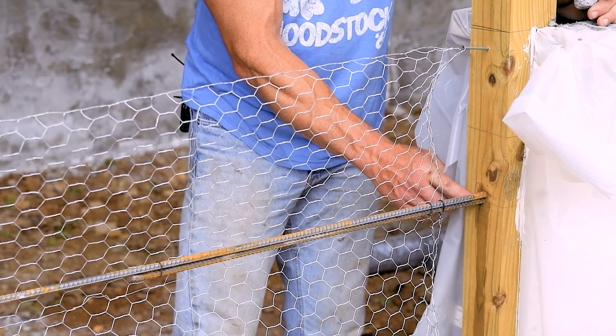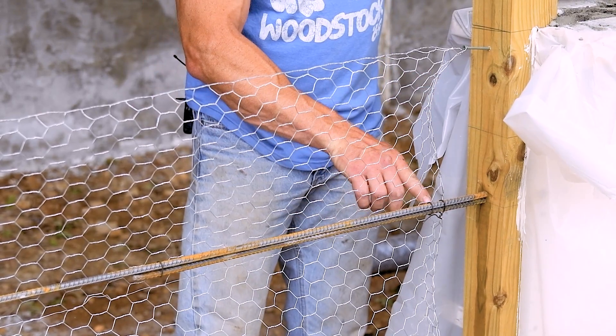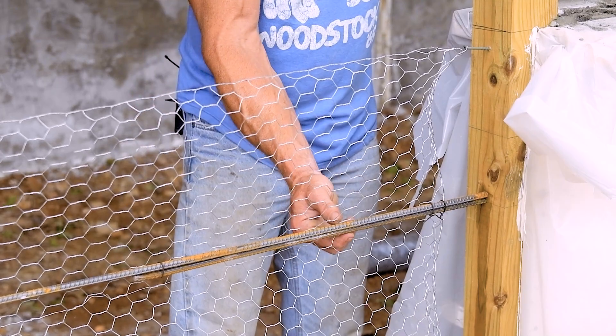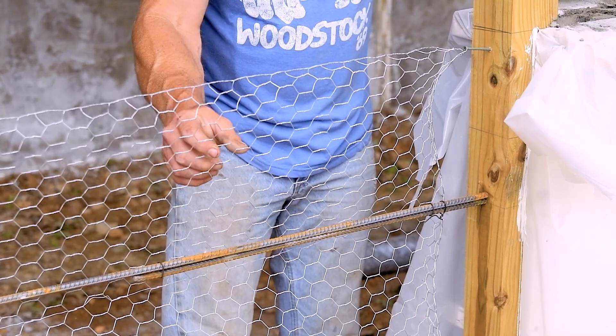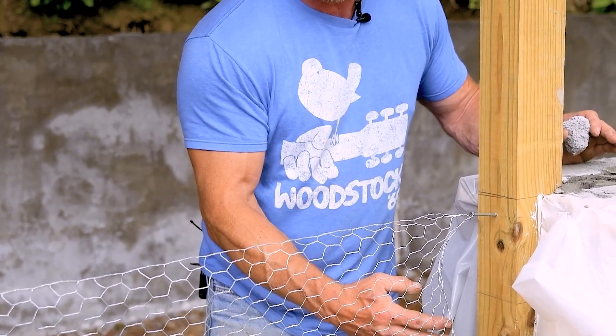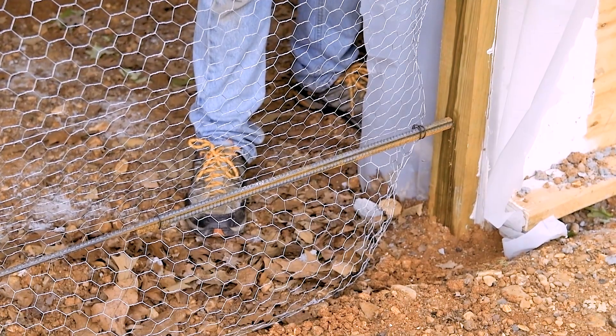When you're building these, you want to make sure that you have some way of locking this panel into this post, because you don't want to be able to bump the panel with a lawn mower or your car, or even put a ladder on the outside and have the panel fall in from the post. So what we did was drill holes in the post completely and put 3/8 inch rebar all the way through the post. We just overlap it — you can see we tied it. This is about a two foot overlap, and the tie wire is tying the rebar together. We also tie-wired the chicken wire to the rebar and twisted 3 inch screws into the chicken wire and screwed it into the post.